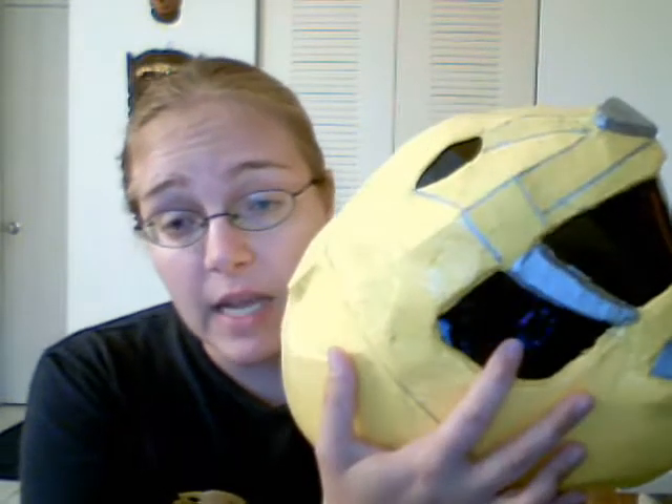One of the worst parts was this thing here. I'm pretty pleased with how it turned out in the end, but it took hours and hours of work. The first mistake I made: polycarbonate is not the same thing as acrylic. When you go to Home Depot and pick up a sheet of acrylic, they're going to have polycarbonate right there with it. The polycarbonate is not going to work — you can't bend it the way this one's bent. Maybe if you got really high temperatures you could do it, but I got frustrated and couldn't do it.